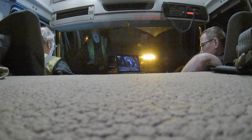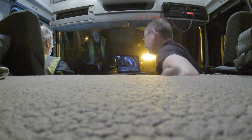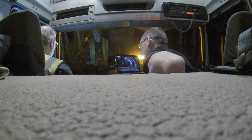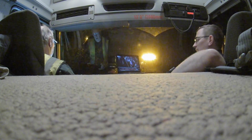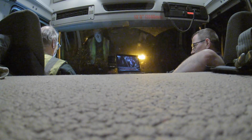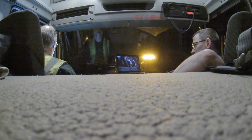Right, let's see what we say. Oh my goodness. Oh, SCR catalyst error. How do you know that when the engine's off? No, this is logged. It's logged as a red. Oh, it's just come out of service as well. 2.2 is normal. We get the immobiliser comes up as 2.2 because it does it too quick, it can't read. But the other red one is 5842-31. God knows, we'll see what it says. These things are just a nightmare, man. 23 sensors on the engine, you know. All to make a bit less crap.